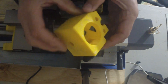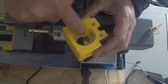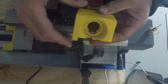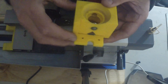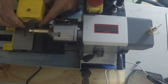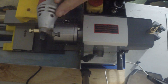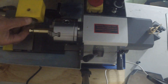This is what the Dremel tool holder looks like. It has a taper where the Dremel tool taper fits in. On the other side this is where the tool protrudes out. This surface interfaces with the compound surface, and these two surfaces register on the side of the compound. The tool holder is then mounted on the compound slide and attached with a screw from the top.